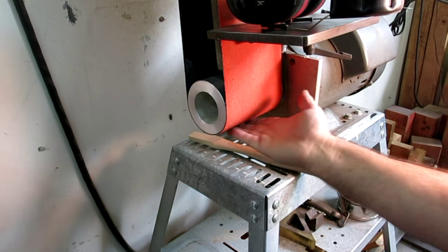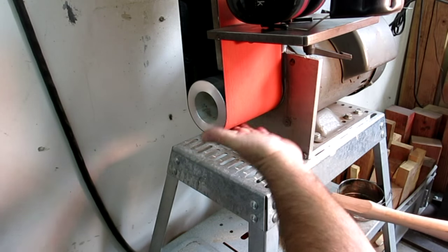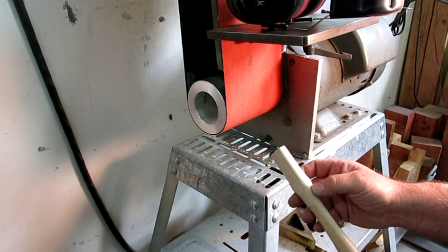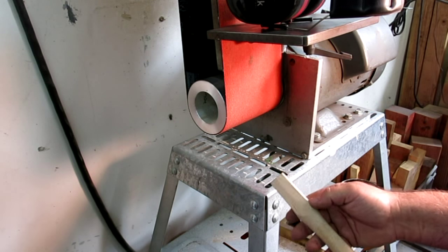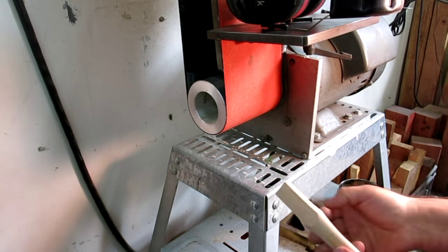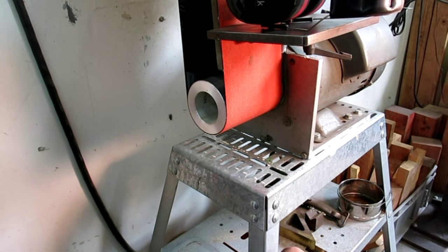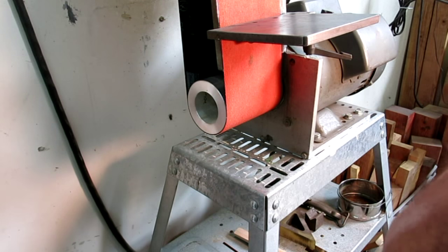Okay, so I like to do this on the underside of the roll here, and the reason is it's got a radius here that kind of blends in and matches with that. What you don't want is to end up with a hard, sharp corner there when you're doing this. So what we're going to do is we're just going to come in here like this, and we're going to come up right into that little swell, okay, and take a little off of this width as we check fit this, okay? All right. So, get some hearing protection on, and let's do a little bit.